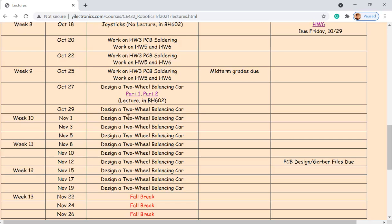So the disadvantage of using this breadboard here is that whenever it's moving, because the accelerometer is super sensitive, it's going to change the position of the mounting, the angle of the sensor on the board. You can see it's shaking, it can even change the angle by my finger. So I highly recommend that you solder this one to the female headers in the drawer. Solder that one to a prototype PCB. We are testing everything, and then plug this in that header, so it's not moving around like that.